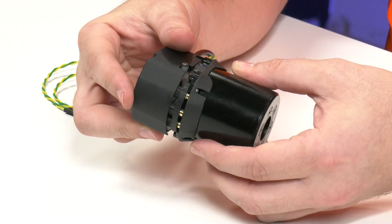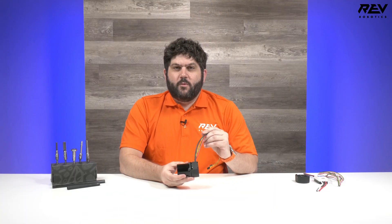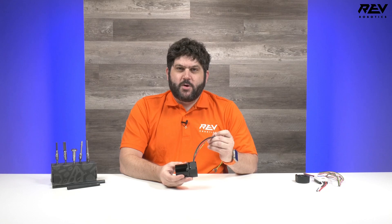One of the core features of the Flex and the Vortex is their dockable design. You no longer have individual wire connections for individual phases and the motor sensor cable — those are all done directly by docking the motor and the motor controller together. This aids you with really much simpler wiring on your robot because you only have to worry about power and signal, but it also preserves the ability to replace only whichever product needs to be replaced over time, without the entire cost of the entire unit.